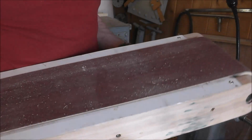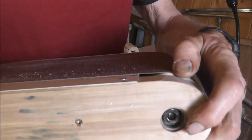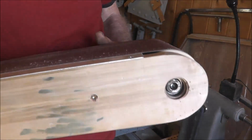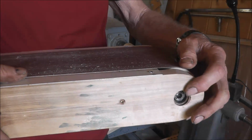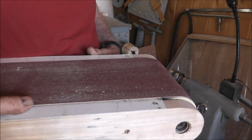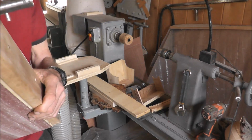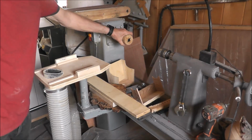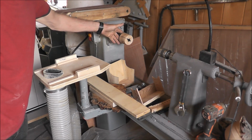So anyway, when I first made this one, I planned on the motor, so I had a center in the shaft, but I had to drill a hole in the end here in order to use it on the lathe. Then I've made one up already for the YouTube for different steps, and I have that shaft sticking out, and I'll show you that one later, but I thought I'd demonstrate on my prototype. The first one that I used a chuck, and then that little pin, did I show you that before? That just went between the jaws. Well, I made this little chuck right on the lathe so it's perfectly centered, and then cut a slot in it for the pin, and you just cut right through it. Of course, it's screwed on there, that's okay.